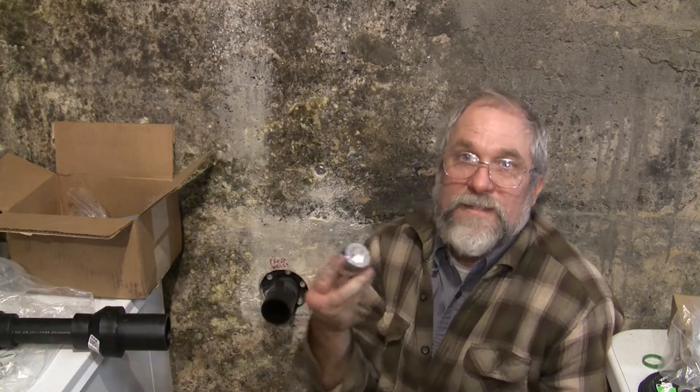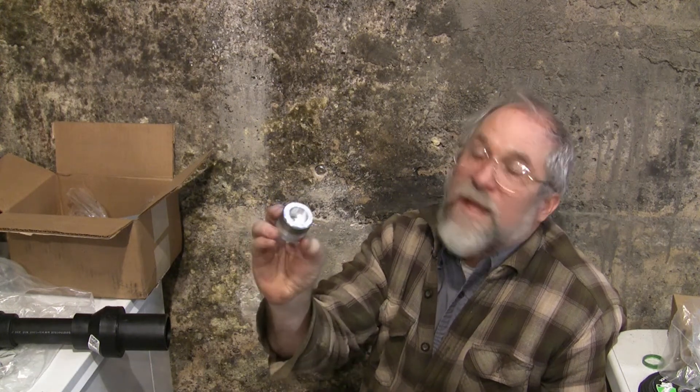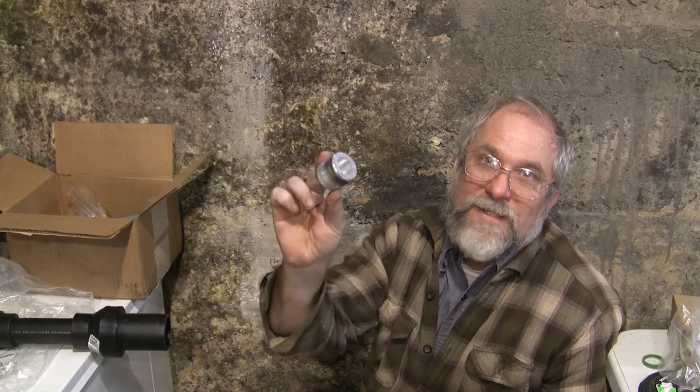This is what my die looks like — probably the biggest difference between my dies and their dies is mine don't have the fancy non-stick coatings, so I can see a little bit of HDPE smear on this. But it doesn't appear bad, and my sockets sure look good. So we're going to go ahead and give this a try.